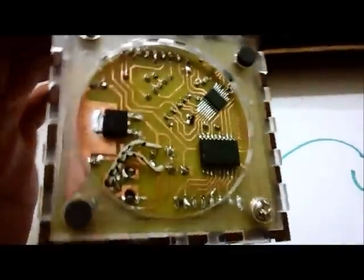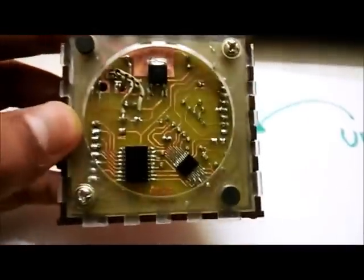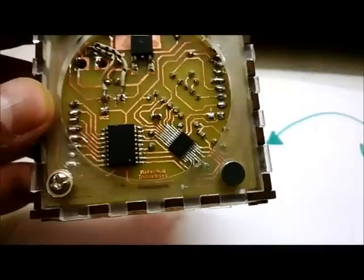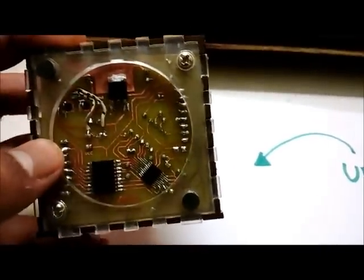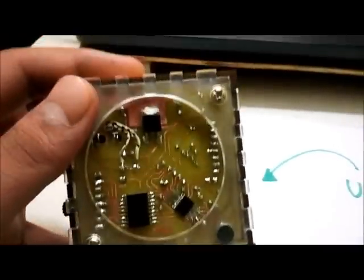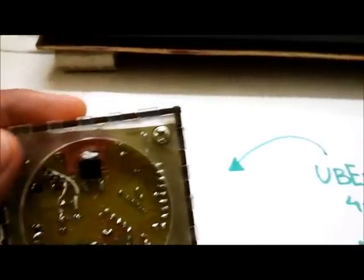Let's see how the circuit looks like. In the circuit we have a MSP430 G2553 controller in a TSSOP package. We also have a ULN2803 Darlington and a TLV 1117 3.3V regulator for powering the circuits.